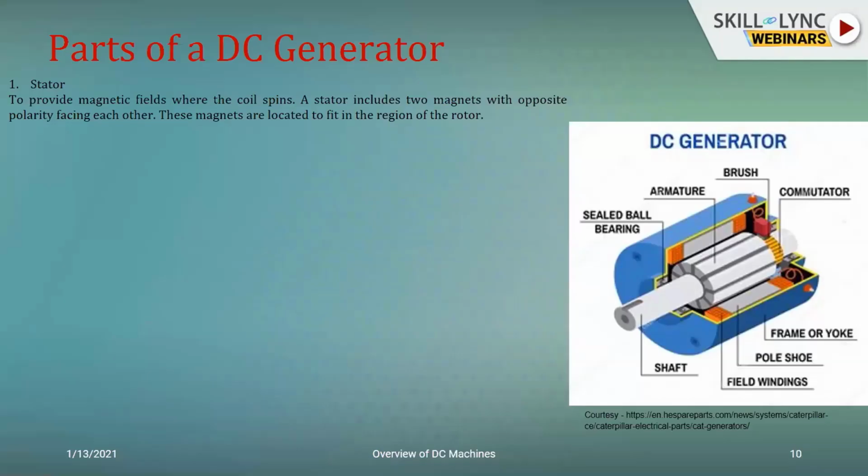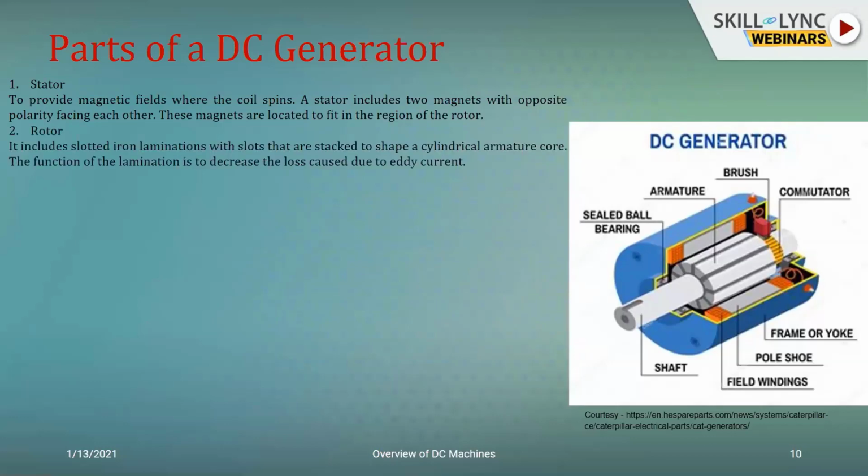So if it's a DC machine, you will be having permanent magnets depending upon the torque requirement. If it's for a small laboratory scale application or for student projects, we can go for a PMDC motor. But if you're talking of huge industrial applications, then we need to talk of electromagnets, wherein you have everything working in the alternating domain, which would then in the end be rectified to provide the direct DC output.